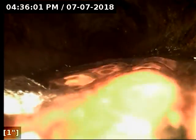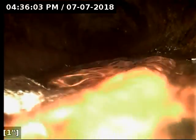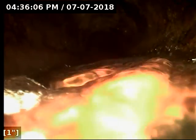Unfortunately, the clean out front, the cap is completely seized onto it and the flange is spinning. So anyway, there's a lot of turns getting to this point here. I'm hoping we can get a fair distance out, if not all the way. It's going to be kind of a tough one though. Now, if we can't get all the way, you may actually have to modify that clean out there so we can gain access to it.